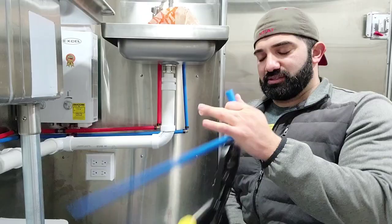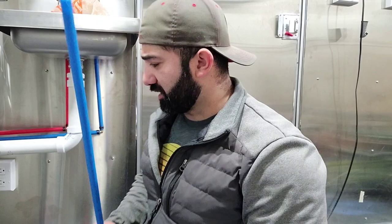That's the elbow that goes down into that piece right there, and then we're just going to connect this to the strainer and we are done with the PEX. Make sure you use blue PEX and red PEX — color-coordinated so you know what's hot and what's cold. You guys can do it — I use PEX because it's flexible, easy to use, easy to install, and it passes inspection at the end of the day.